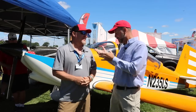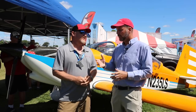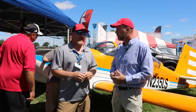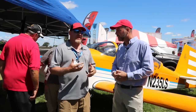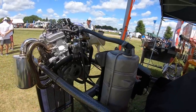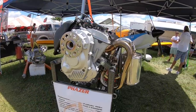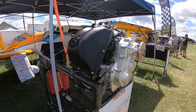Given your background and resume, what did you research before designing your own gearbox — the engineering and technology involved? I learned the engineering basics of transferring mechanical force from one place to another, and then a whole lot more I'd never learned in school — gear pressure angles, gear tooth hardness, different gear materials. I had to open a lot of books. I also talked to other people who had created drives before; some wouldn't share anything, but there's a wealth of knowledge out there, including a lot of hot rod guys who had built their own rear ends.